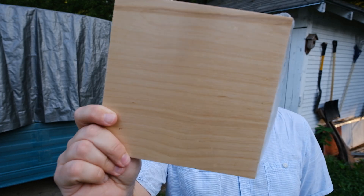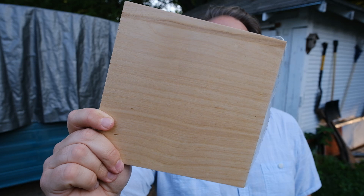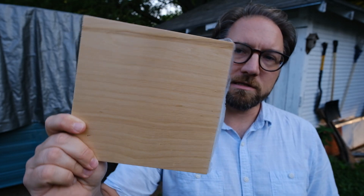If you were really doing a period-correct restoration, this is what you would do on most of these. But overall, not a huge fan of this. What I did really like was the polycrylic because it's essentially clear and it really brings out the grain and the nice color of the birch. It doesn't have quite the same sort of iridescence that the amber shellac does, but I do really like the way it looks, so I would love to do this.